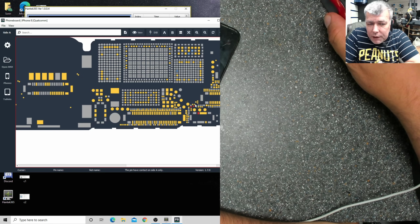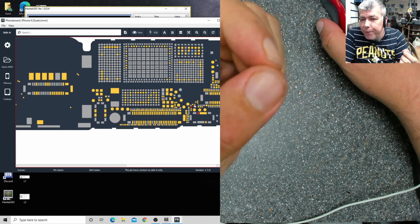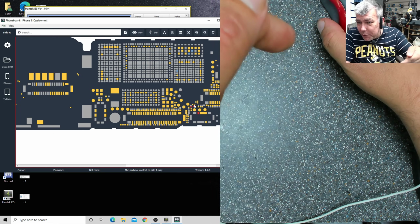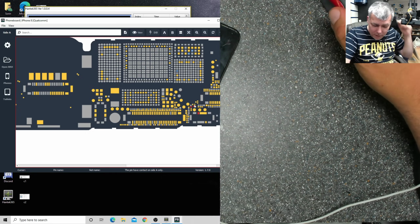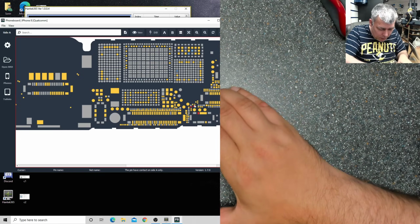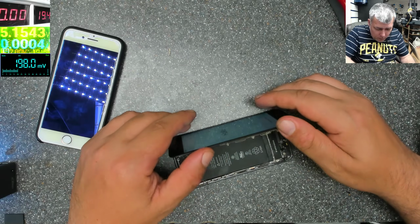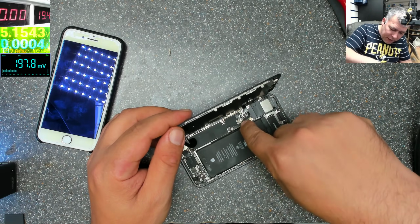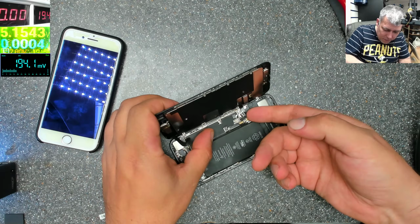So what happened with this? Actually, one of these transistors is getting damaged very easily. You will damage that with your nail, when you try to use your nail to take out the battery connector. You will break that transistor. Okay, let's have a look on the board. Let me take the board out first. It happens so many times because, obviously, look, how is the battery? You put the nail here. Exactly where are those transistors?